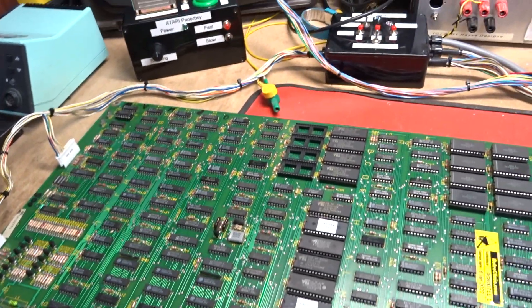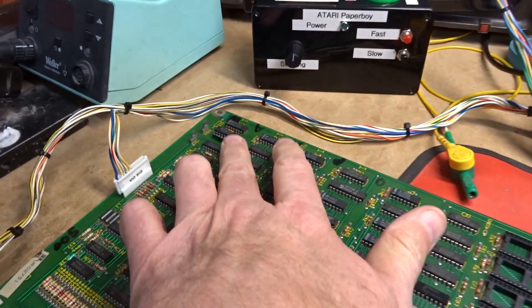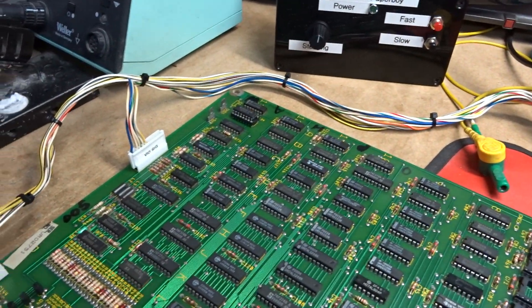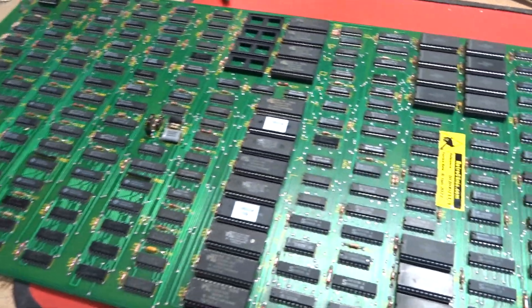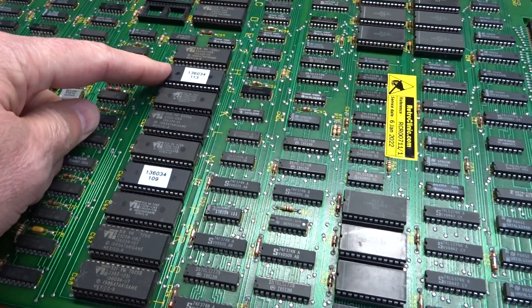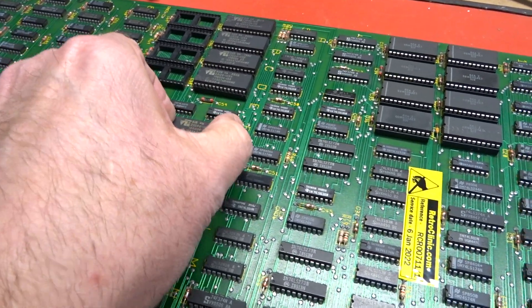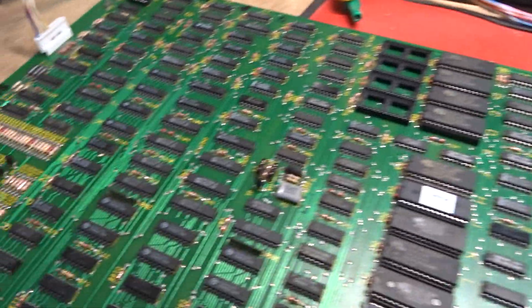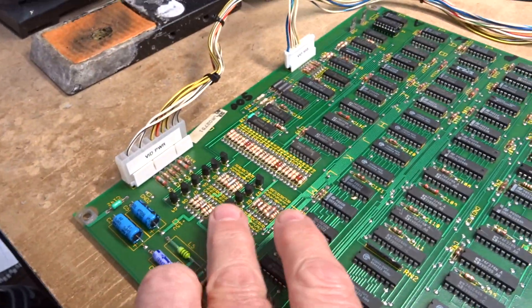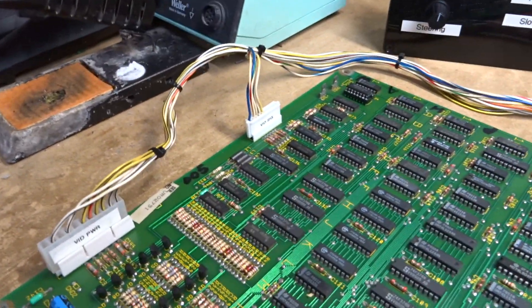On the video board, this was just dead, not booting at all. The issue was an S112 in the clock circuit. Once I replaced that it came up, but it did have some graphical glitches — that was two bad ROMs on the board, and a ROM socket was damaged as well, causing intermittency when wobbled, so I've put a new socket in there. I've also done the service parts, which are the output transistors, as well as several new caps all around, and new edge connectors for the power and the video.